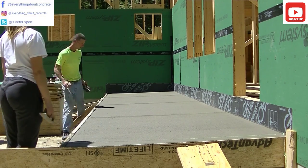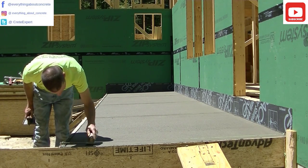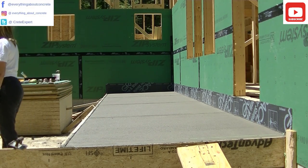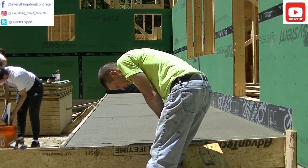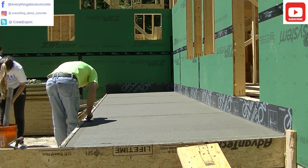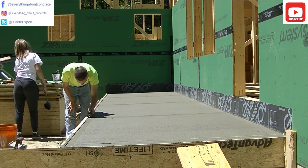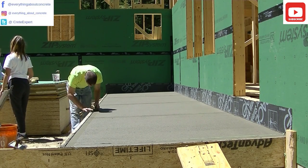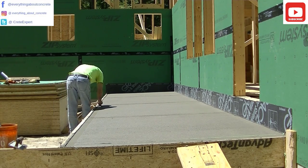Putting that finished edger mark on really makes the thing look nice and finished. I could only reach out so far from the front, so I had to go out back and finish those grooves. Now the last thing we're going to do is put the edger on it. We like those brass edgers — they turn down the edge about a half an inch, leave it nice and rounded, and leave a really nice smooth looking tool mark. I have those down in the description also. You can see how it gives it that picture frame look. Well, that's it guys — that's how you finish a concrete entry patio. Thanks for watching.